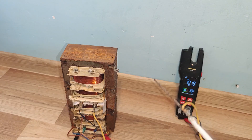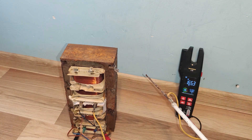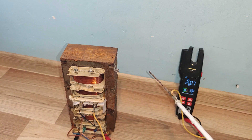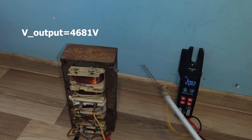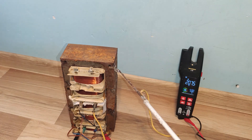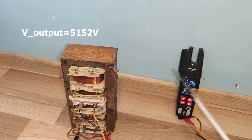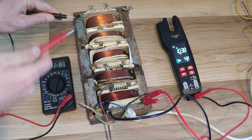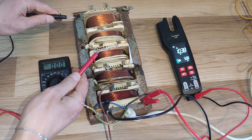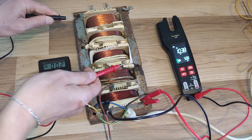At this point I noticed some strange buzzing which portends failure — listen carefully. Let's get to full power, which is 230V. You know what they say — these devices run on smoke. If you let the magic smoke out, they stop working. After doing some measurements, it seems I have another coil that shorted the iron core. In total, I have isolation failure on 3 out of 4 secondary coils.